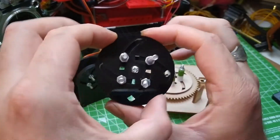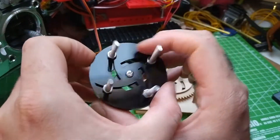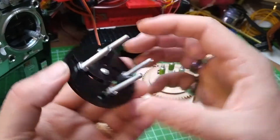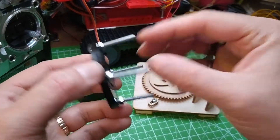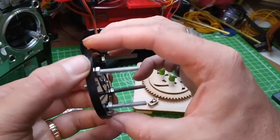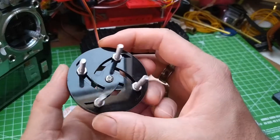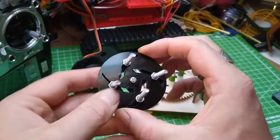These four jaws travel in and out — you can design them with more jaws: six, eight, lots of different amounts. One of their main uses, and probably where you see these most, is with wood turners, obviously much larger and better built. They're useful because they can grip the inside of bowl objects, hold a bowl within the jaws, or work internally and externally — they're good for holding non-cylindrical, bowl-shaped objects.